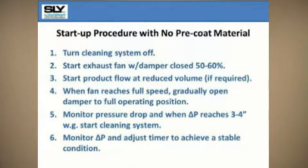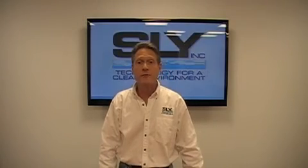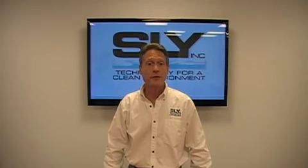And at 3 to 4 inches of differential pressure, start the cleaning system. Continue operation of the baghouse and adjust the pulse cleaning timer to maintain a 4 to 5 inch water gauge differential pressure. Now this concludes our training video on proper startup procedures for dust collectors.